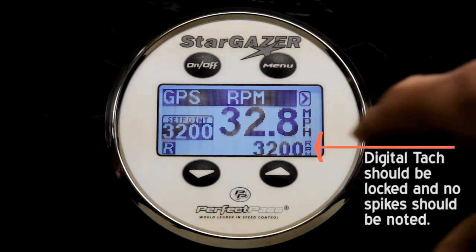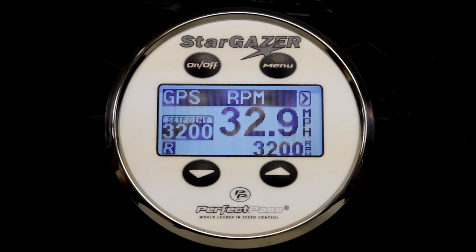Closely watch your RPM tachometer. You want to make sure that there are no spikes on that line — in other words, it should hold and not move more than 10 RPM or so. If you see any 20, 30, 40, or 50 RPM spikes moving in and out, that would indicate the RPM signal is not clean and may need to be inverted. On this particular boat you can see that things are very smooth and consistent, which indicates all is well.